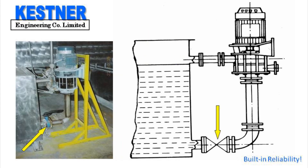When the outlet or suction valve on the bottom of the tank is opened, the liquid level in the pump will equalise with that in the tank due to atmospheric pressure, thereby covering the impeller which is essential for the successful priming of the pump.